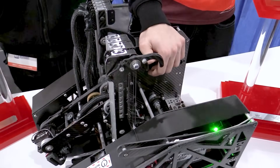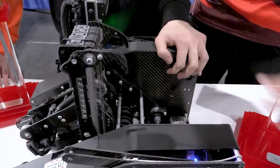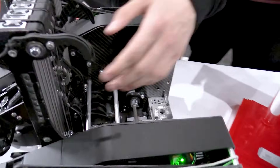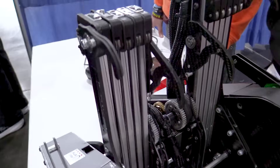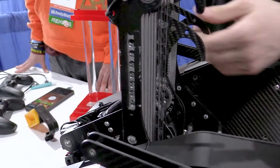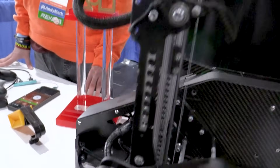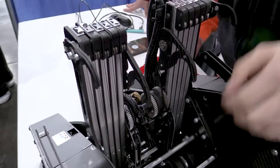This lift is the central mechanism, and we tried to optimize it as much as possible throughout the season — that's why we went all-in, even thinking about saving 12 grams wherever possible. For the stringing on the slides, stringing on two sides loses a lot of efficiency due to tension in the string, so going for one-side stringing was a conscious decision from the beginning of the season.